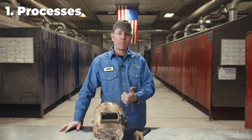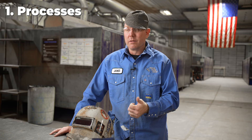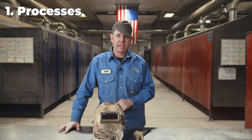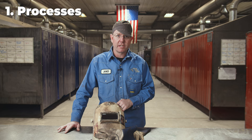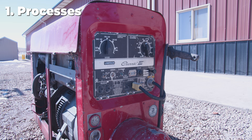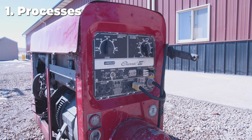Start out with your size, then ask what processes you're going to need. If you're going to be doing a lot of high-tech wire feed, you're going to look at an inverter — an engine drive with an inverter setup, like a Lincoln Cross Country or the Miller 350 pipe pros. They're going to have specialty settings for high-tech wire feed or lift arc start on your TIG torch. If you're just going to be running stick welding or regular TIG, you can go get a SA200 or a 300 Classic Lincoln — just run of the mill, pretty bare bones.